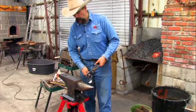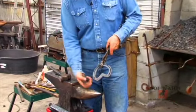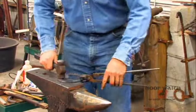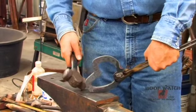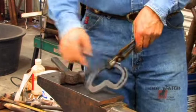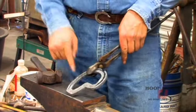Start out with an off-center toe bend. After we get the off-center toe bend, we will do the hockey stick that then becomes our frog support plate, and then do another hockey stick that becomes the back of our shoe. So we'll upset into there and upset into there. And the move for making that hockey stick was to put this portion of the shoe on the anvil, turn the hammer in our hand, and hit with a straight swing, but an angled hammer. Bend this piece around, do the hockey stick that then becomes that portion of our shoe, and bring them in together, weld in the middle.